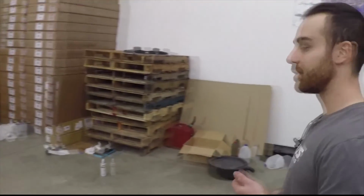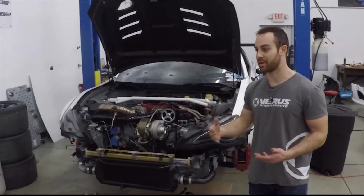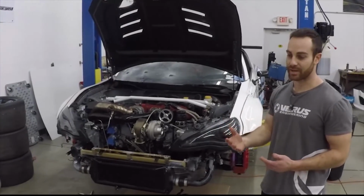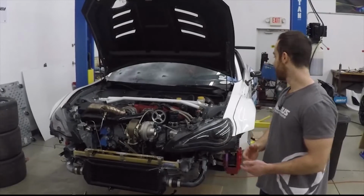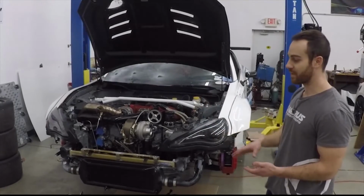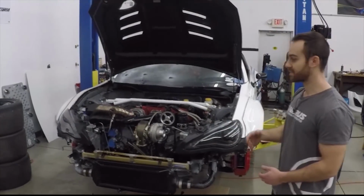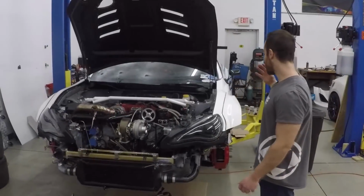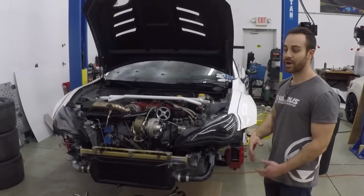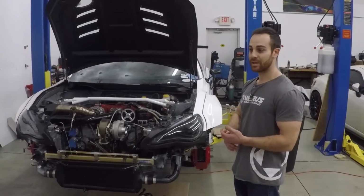One other question that I've seen a few times is, I'm surprised that the car only made 100 pounds of downforce, and I figured I would kind of expand on that a little bit, because I guess it does kind of seem unrealistic when you look at the values that the wing and a large front splitter normally put on. So the top of a car actually produces lift, and that's because the car is in essence a very disgusting wing upside down. So the top surface actually has negative pressure and is actually pushing the car up. So all of these areas, the fenders and the wide body, all those locations actually increase the area that lift is acting. And the car itself actually produced about 700 pounds of lift in this form.